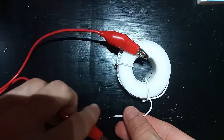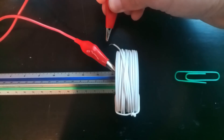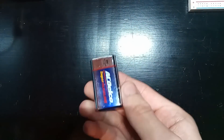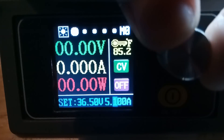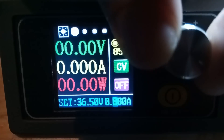Last episode I was using my power supply to magnetize this coil, and this setup was working to launch some paper clips a few inches. There are two main issues with using my power supply to power the coil directly though. The first issue is that it's connected to my wall, which limits the portability of the gun. The max current of the supply is only 5 amps, which is problematic as we need more current to create a larger magnetic field that can accelerate the projectile faster.